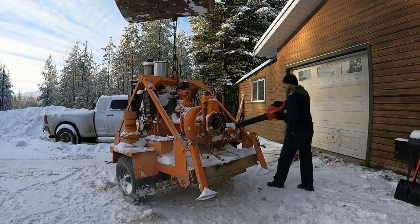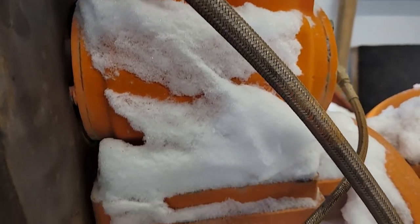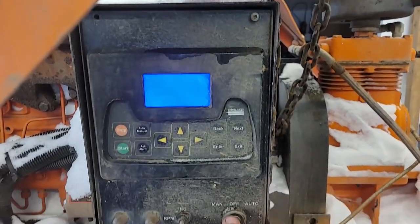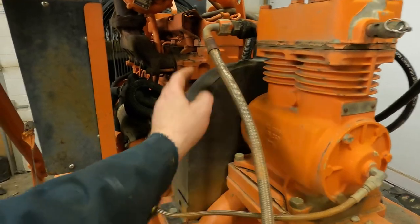This is my 8-inch self-priming Godwin pump. It is the second most expensive piece of equipment I own on my site. Having a reliable pump has been on my wish list for many years, and two years ago I finally got it. It is currently in need of mechanical repairs, but this has been the only problem I have ever had with it — I absolutely love this thing. This pump needs a quick job: I have to change the priming belt on it for the air compressor. These Godwins use a dry prime pump system. The compressor is driven off the engine and sends high pressure air to the Venturi unit. The air flows through a small orifice in the unit and out the discharge hose, drawing water up the intake side.